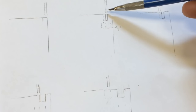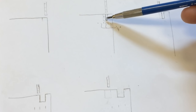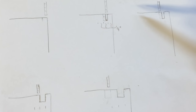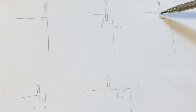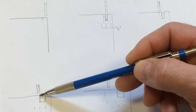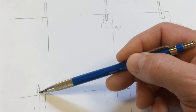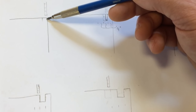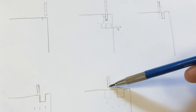Depending on your blade thickness, you'll probably need to make a third cut down the middle or you'll end up with a little strip of waste in there. That's why I do three cuts per slot. After making this last cut, you return the gear back to the home position — complete the turn. At this point, the blade on the right side is lined up with the right side of a finger, exactly where you started. You just repeat the process: do the full turn to give yourself a quarter inch and you're ready for your next finger.